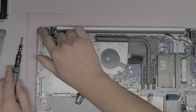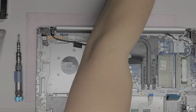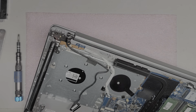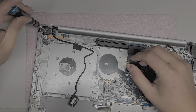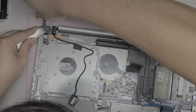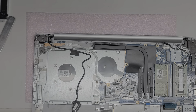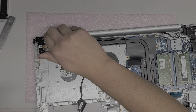Let me try one other thing — I'm going to try heating this screw up and hopefully that will melt the thread locker. I'm going to heat this up. Now the thing's spinning extra loose. Let's see if I can pull this up as I twist it. It doesn't want to come out at all. I'm not sure how I'm going to do this because they put some metal reinforcement things that I can't take out.